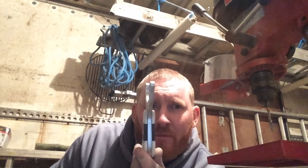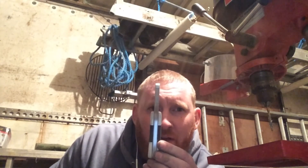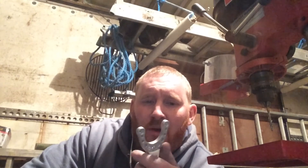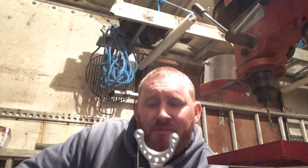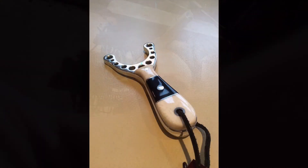I'm not going to do any more videos on sanding, but I will do a video on polishing and the final finished product. That's been done today from scratch — the only thing I haven't done today is drill the core; the rest has been prepped. I've managed to get the lines nice and level. As I said, with cast frames there can be scratches you just don't see until you've got to 3000 grit or started polishing. Sometimes they're minimal, sometimes big. If I'm not satisfied I'll take it back down to 800 or 400 and keep going back up. Sanding and polishing can be obsessive — I'm happy so far, lads. Cheers, thanks for watching.